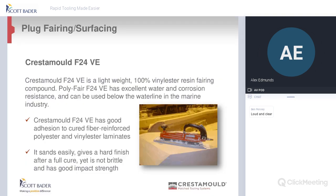So you've done your plug, you've CNC'd it. We come on this slide, and the next slide is pretty much the same. So you've got this version, which is F24, which is vinyl ester, so it can be used below the waterline, and it's basically a fairing compound or a body filler as such.